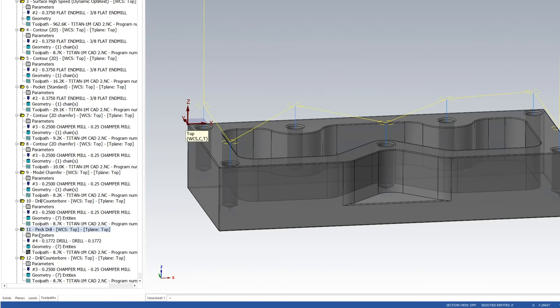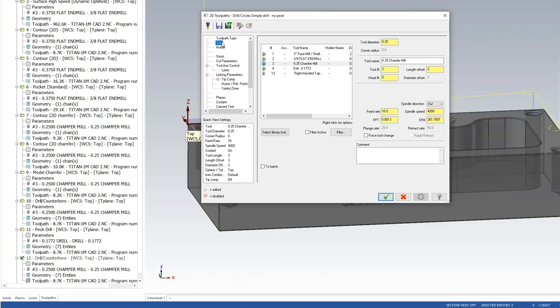Now let's go to the next one — tool five. Hit parameters, go to the tool — we're almost done. I'm going to go to right-handed tap, that is our 10-32. Let's go nice and slow: 500 RPM, spindle speed 500. Feed rate calculates perfectly. I just noticed I didn't change my tool number — so let's go ahead and do that. Tool five. Now you can see it's tool one, two, three, four, five — perfect per our setup sheet. Come over here, we're going to say rigid tap. Everything is blocked out because it knows — it's going to go in and come out perfectly.